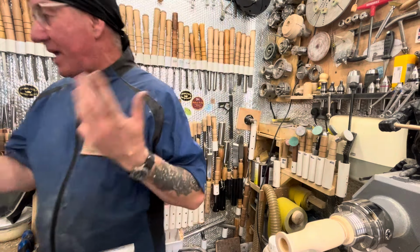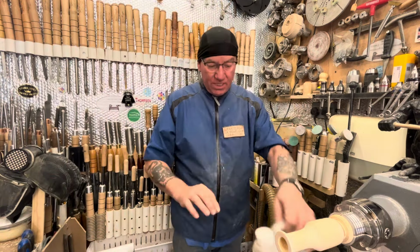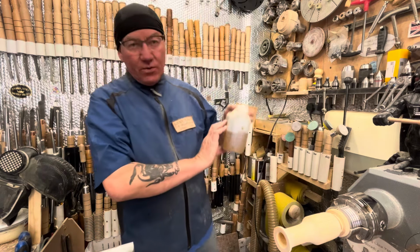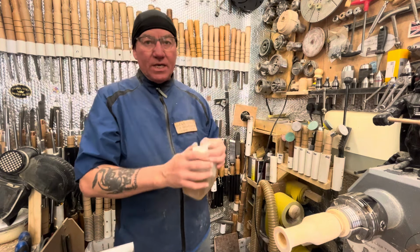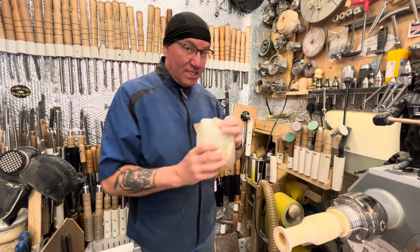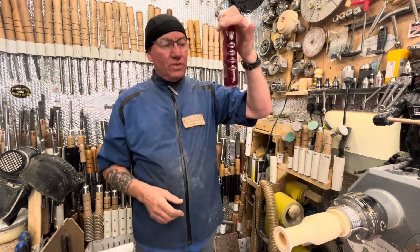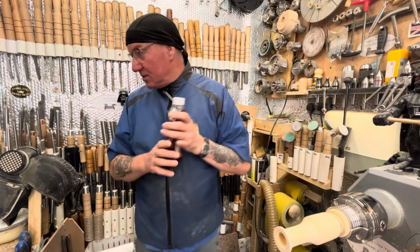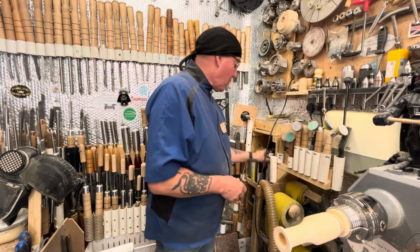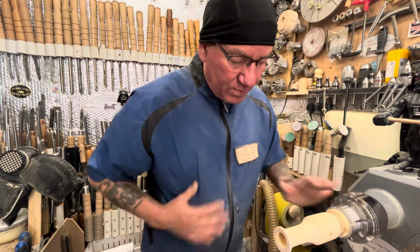Right. So anyway, the flakes. So put in now, whether you want to do that by measurement, by putting it in and seeing how far it's up, or whether you want to do it by weight. If you do it by weight, 1 ounce of that to 10 fluid ounces of denatured alcohol. Okay, put it in, just leave it to dilute. That will give you a thin enough mix like this. I find it works perfect as a sanding sealer. That's it done with methylated spirits, which is denatured alcohol, which is hard to get in some places. Okay, works just exactly the same. Right, for this sort of thing, I can put this on quite, and I want my sanding sealer, I'm putting dirty finger marks on it.